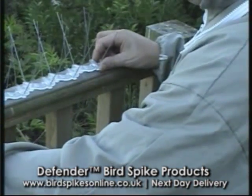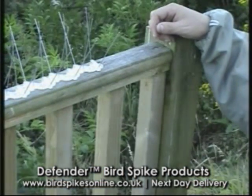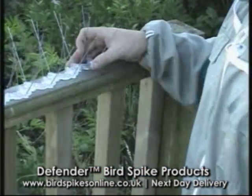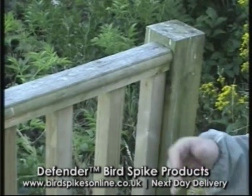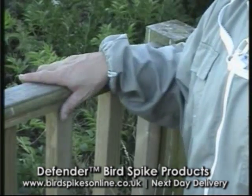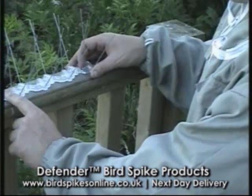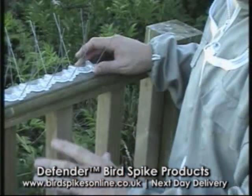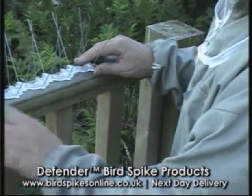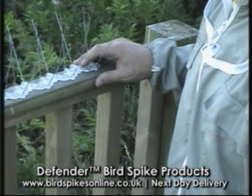I would leave that on there for a couple of weeks or even just a week. The pigeons then will not be able to land on there. They'll move elsewhere, and then you can simply undo the screw or cut the cable tie, and then remove the spikes and put them back into storage. If at a later date the pigeons start using the banister, the handrail, again, you can simply put the spikes back on. So the spikes don't necessarily have to be a permanent feature. If it's an area where you don't want to see the spikes all the time, you could simply put them on there for a short term until the pigeons find a new site to go to.